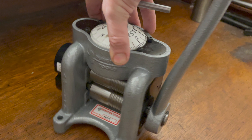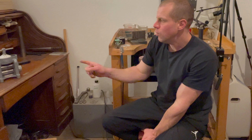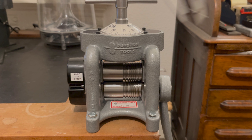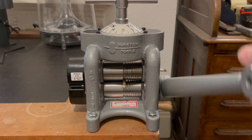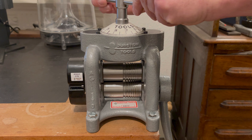When compared to vintage mills, the C70 stands out for its modern engineering and precision. Vintage mills carry the charm of history but often come with idiosyncrasies that can challenge consistent results. The C70 on the other hand offers reliability and uniformity in every pass, whether you're creating wire or sheet metal. For specific tasks like creating detailed metal forms or intricate textures, the C70's precision stands it in good stead. However, for those looking to process larger ingots or requiring extensive reduction, the larger Durston models or a well-maintained vintage mill might be more suitable.